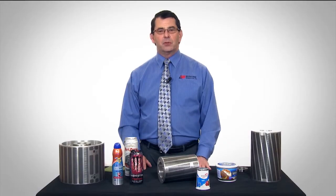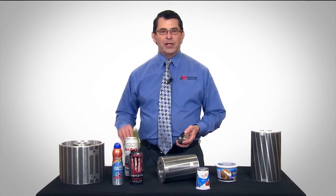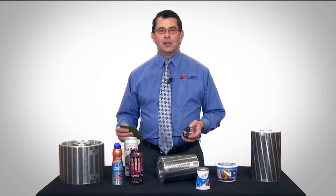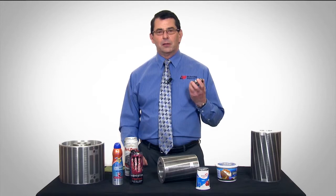You need to inspect all of the individual components in the process, including the shaft, the bearings, the magnetic printing cylinder, the plate, and the blanket rollers. You may find that truing up a shaft or replacing a bearing can make all the difference that you've been looking for.